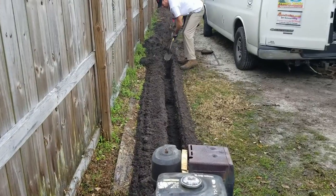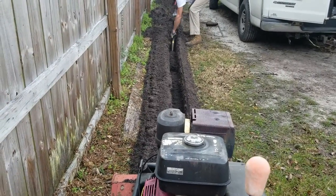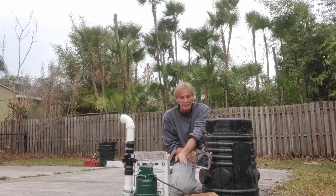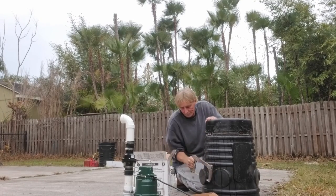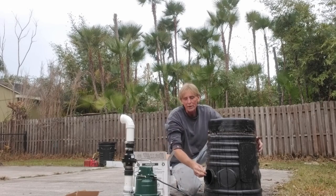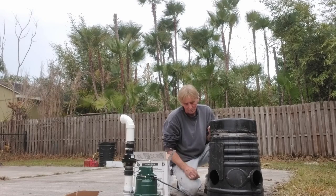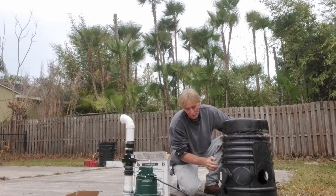What we're doing is coming right behind the trencher and just getting the excess out. This is such fine sand, a lot drops back down. We've set up the pit and we're going to go ahead and cut this nipple off - this is one of the inlet lines from our collection in the backyard. A good sharp hacksaw makes that real quick and easy. We've got two collections, done with a four-inch hole saw, so we've got two lines coming in from the back into the pit.